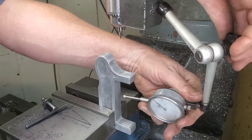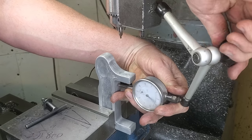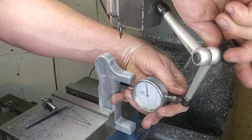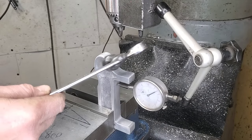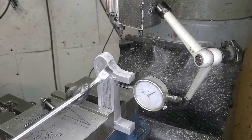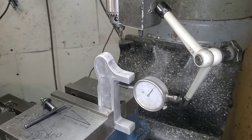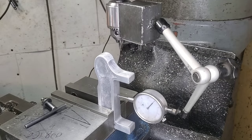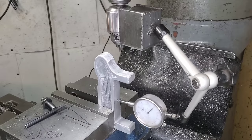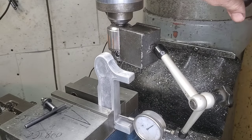There's probably a better way to do it other than chucking it onto the drill chuck, but this is going to work for what I need today. Remember that machined surface we had for the reference point — this is what we're going to dial everything into. I know better than tapping on that while the dial indicator is on there. Those gears inside that dial indicator are so small and so fine — that's a really good way to mess up your dial indicator. We certainly won't be doing anything remotely close to that with the Fowler dial indicator, which is going to be part of this whole gift I'm giving to the old motorcycle mechanic that lives just down the road.